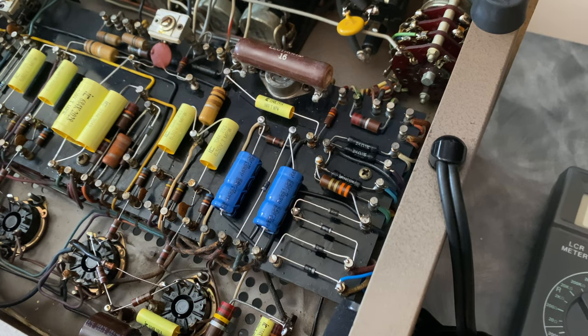This one got a modern diode, and because of the pegboard design, axial capacitors are the best choice just for fitment inside of the unit. But sometimes it's hard to find very long life axial capacitors. So I spent a little bit more on these just to make sure that I got a really high quality, long life Vishay part in there that's going to be in there for the long haul. And then there's also a couple other axial electrolytics in the front end circuit, which I did Sprague Atoms just to look the part.